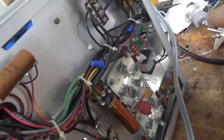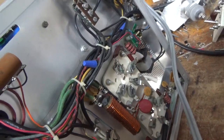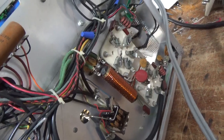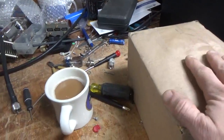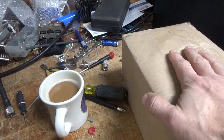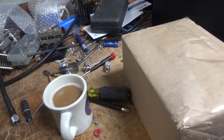It is also getting a new softkey board — that is a very early one. And the SO239 checked out okay. Big news: caps came for the 160 through 15 meter amp. So next week I will pull the capacitor assembly in here and I will put all the diodes and resistors across them.